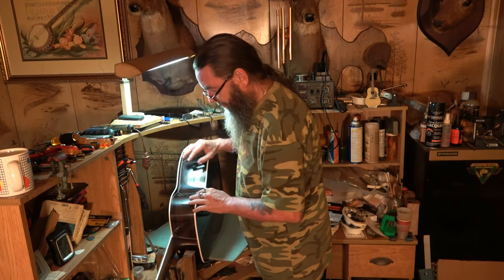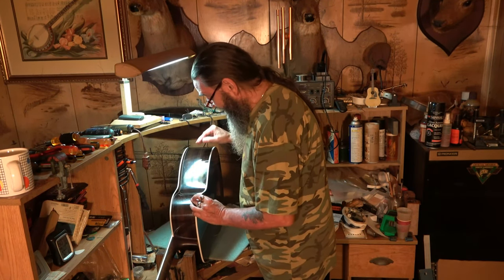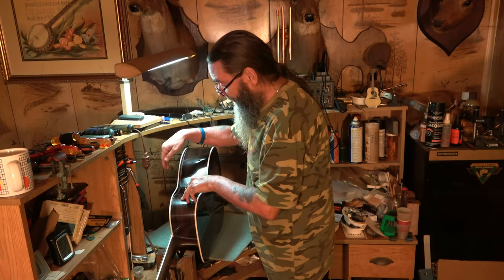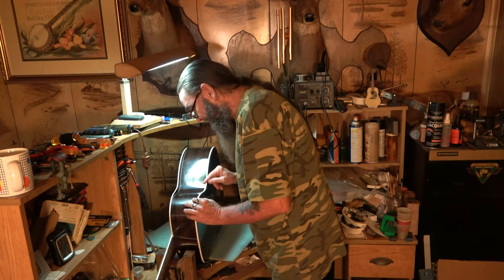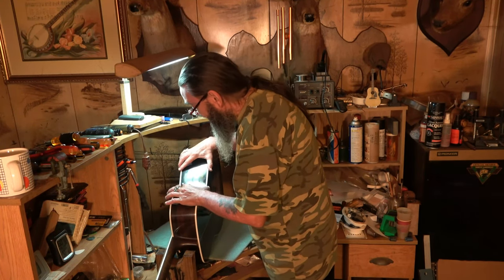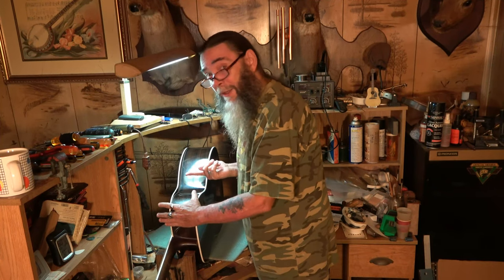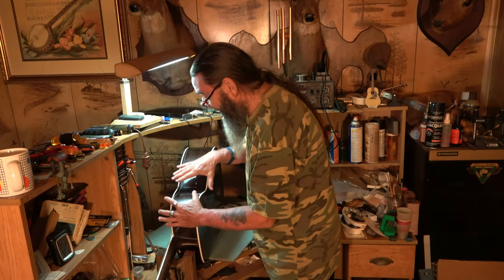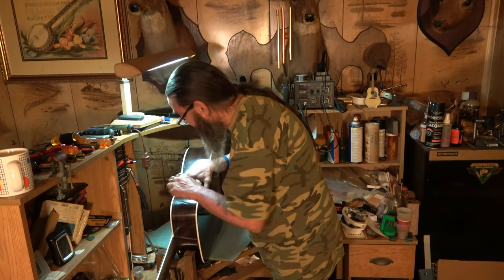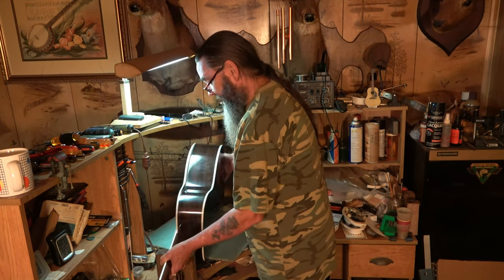I already went over this and scraped all the old glue. Some of it was on the wood down in there, some was still stuck to the binding — that's all clean now. Looking at the binding here on the back of it — it looks like someone has repaired that before. I see some extra glue spots there. I was scraping the glue off and I saw what looked like glue on the side of the binding, and I realized — leave that on there, that's finish. There are places in the finish that it goes right back into and fits perfectly, and you can't even tell it was over a part. That's the way it'll look when we're finished. So we want to leave that on the sides the way it is and just glue it back that way.